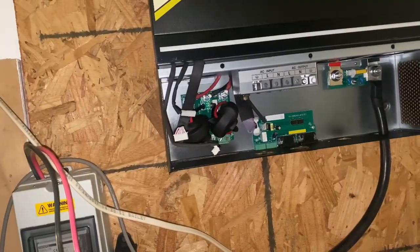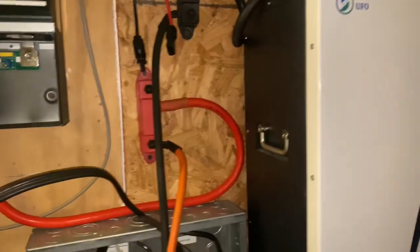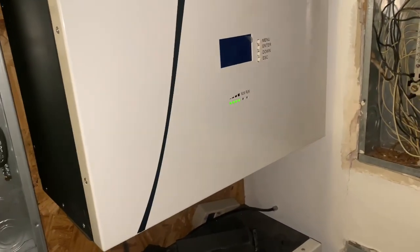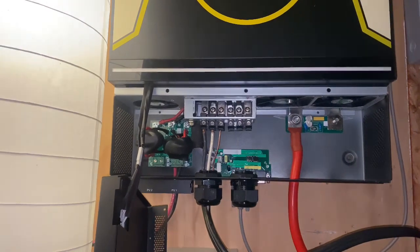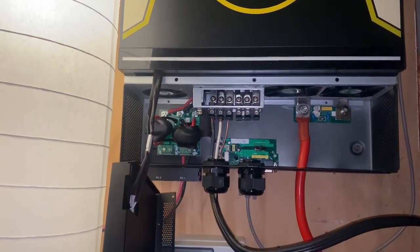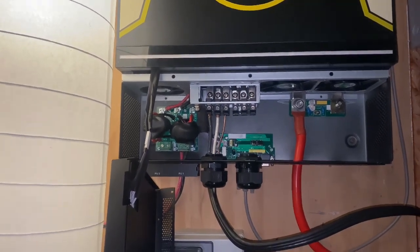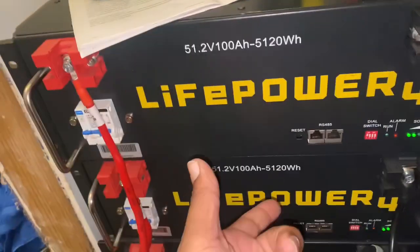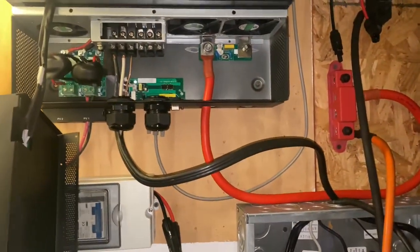I was using it to send power to charge batteries - excuse the mess, I'm starting to clean up and install this inverter for the first time since they sent it to me. This inverter is tripping my batteries every time I cut it on - it gives an alarm on the batteries. Right now the battery is on without being hooked up to the inverter and it's working fine. You see the run light is blinking and everything is working fine, but the moment I hook it up to the EG4 inverter - the old one - it alarms.